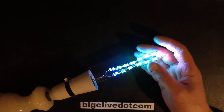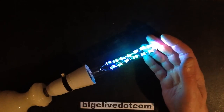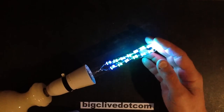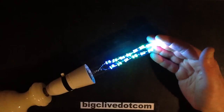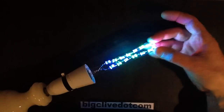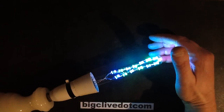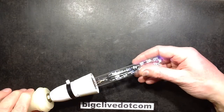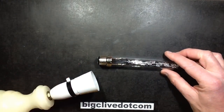Again, this is very low power and a super simple circuit. You can't really see it flickering because most of the sine wave it's actually lit, although there's no smoothing at all. And also, if you plug it into a ceiling light, then the leakage from the switching circuit means it glows visibly even when it's not turned on, which I kind of like. So yeah, pretty nice. I like this one. I might actually make another. And they look very stylish too. Yeah, another good result.